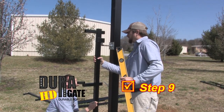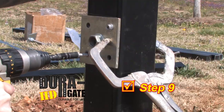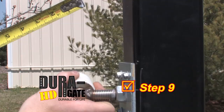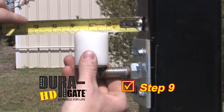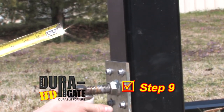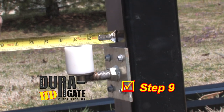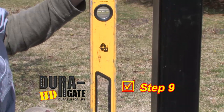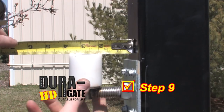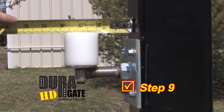Step 9. Remove the gate vertical and attach the bottom galvanized hinge plate as above, drilling the necessary 1-inch hole. Place both of the hinge bolts in the mounting nuts and turn clockwise until the outside of the nylon bushings are approximately 3¾ of an inch away from the hinge post face. Plumb the nylon bushings to each other with the level side to side by turning the hinge bolts clockwise or counterclockwise as needed, with the minimum gap to the outside of the bushing being 3¾ inches.